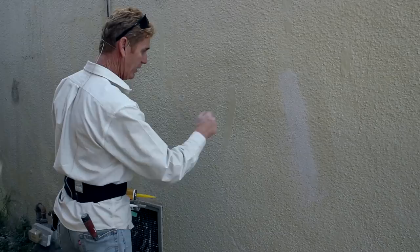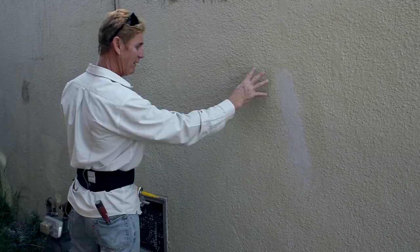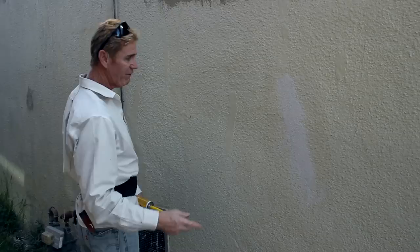There are three ways to do it. You can buy a five-gallon bucket of acrylic - with acrylic you don't even need a primer, you just put the acrylic on it and float it in with a green float. Or you can hit this with Weldcrete, which is a bonding agent, then mix up some soupy cement and throw it on with a dash brush - that's how they got this finish, it's called a dash finish, like in the old days 'a dash of salt.' Or here's a fast way to do it.